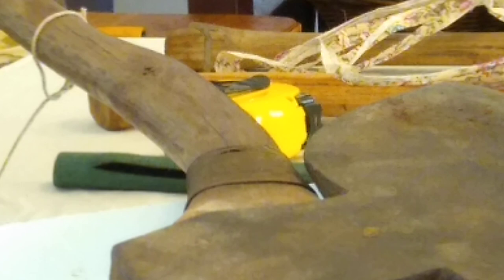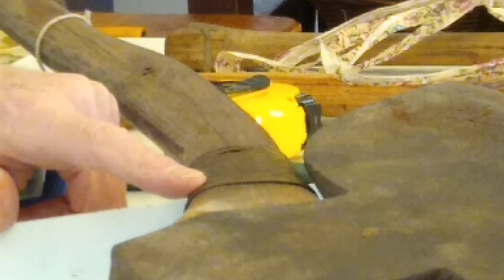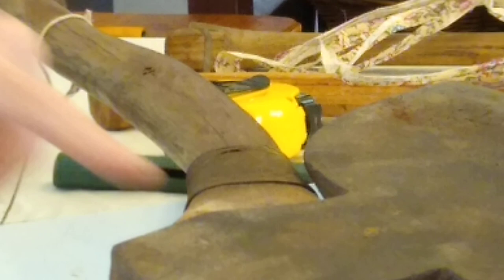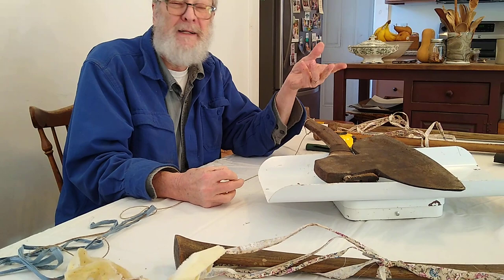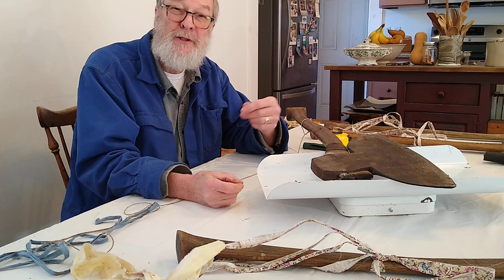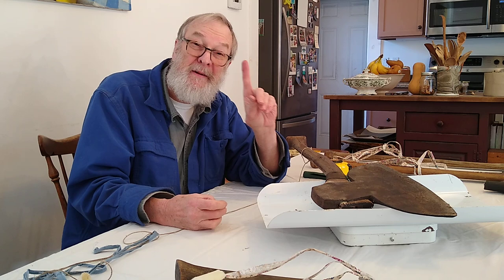If you take a piece of annealed soft iron wire — you can tell because if you bend it, tempered wire springs back — and you tie it to a tree and attach the other end to your axe handle, and you get back 30 or 40 feet, you can actually feel that wire stretching like it was rubber, like a rubber band, only with a stretch. Not very much, just a little bit. And if you stretch it too much, even one time, the wire will become hardened and will lose that elastic quality. So you have to be very, very careful.